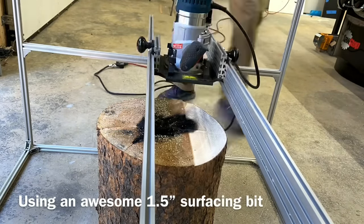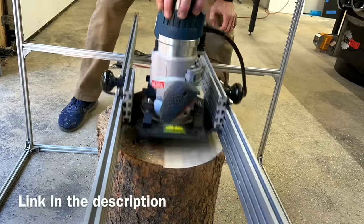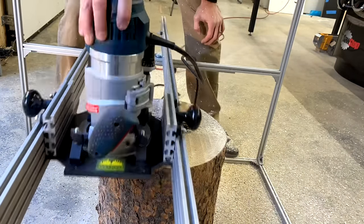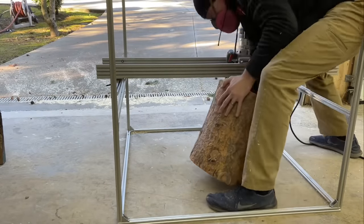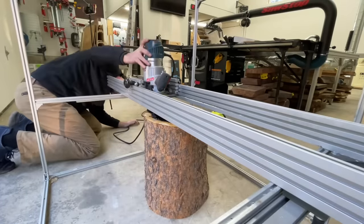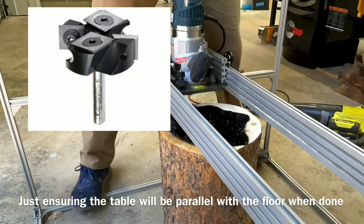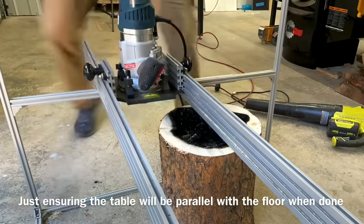You can see my little stump flattening jig — it's a pretty simple cube made out of aluminum extrusion. It's a little light duty and does start to sag in the middle, but other than that it works really well. I really don't like the router I use in this setup, but I really like the router bit — it's an Amana one-and-a-half-inch insert-style bit with replaceable rotatable blades. Not a sponsored post, just a tool I really like and use all the time.